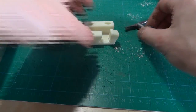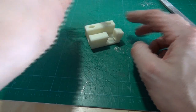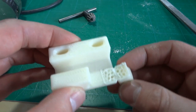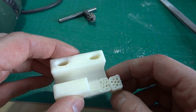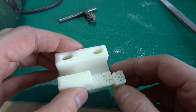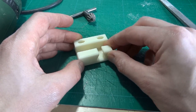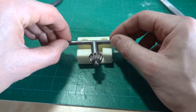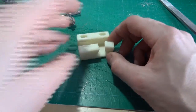On pushing it in to test it, a piece snapped off, which now makes it useless. I've printed this with 40% honeycomb infill, but obviously that wasn't strong enough to hold that piece on. I need to think again — possibly change the model so that the slot is in the middle instead of offset, and make that gap slightly bigger.